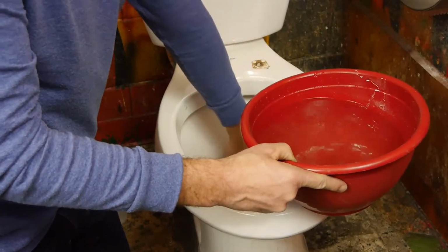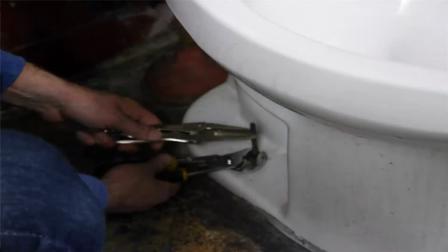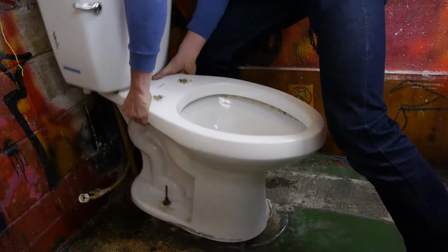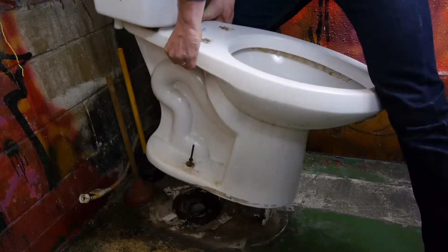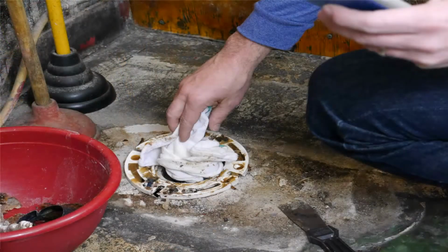With the water out, I disconnect the water line to the tank. Then I get out my channel locks and vice grips and loosen the flange bolts. With the lock washers removed from the flange bolts, I can lift the old stool off the sewer drain and place it on top of the cardboard that came with the new stool. Now I put a bar rag in the drain pipe so I don't have to smell sewer gas. You will need to make sure you remove this though before you put the stool on.